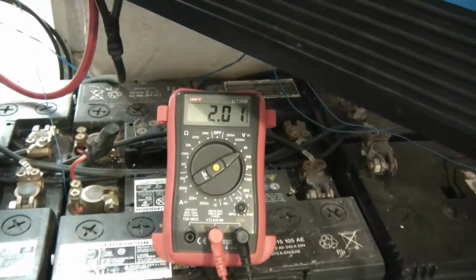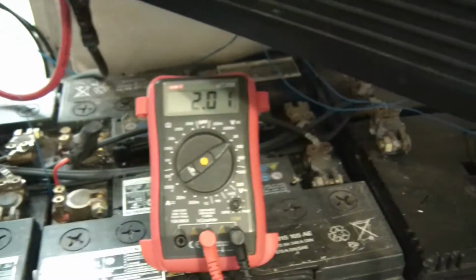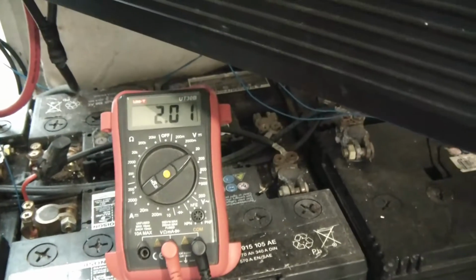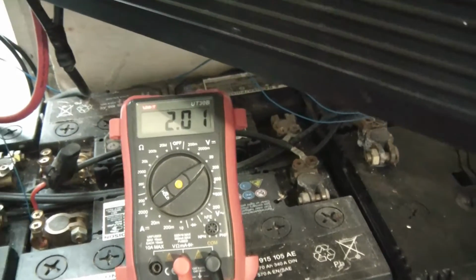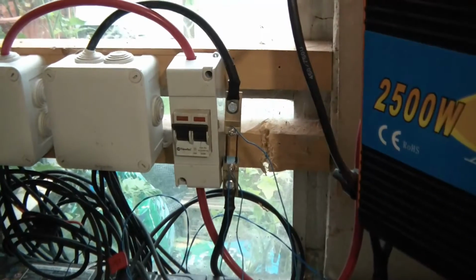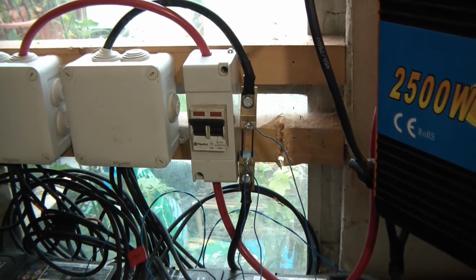And you could be thinking, okay, well the chip over here has a set gain of 20, so for that to be 2 volts, then there'd have to be a 10 millivolt drop. Is that right? Or 100 millivolt drop? 100 multiplied by 10 is 1000, and multiplied by 2 is 2000, which is 2000 millivolts, which is 2 volts. So yeah, if that's 2 volts out of that amplifier, and the amplifier's got a gain of 20, that means that the voltage drop across the current shunt is 100 millivolts, and it almost certainly is not that.